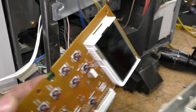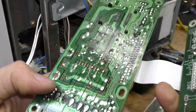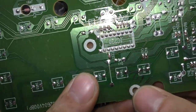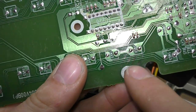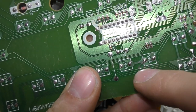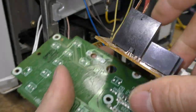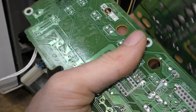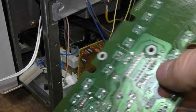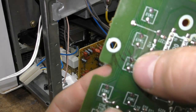The main issue is this track vaporized, with some blackening that I've cleaned off. The way this was packaged, these two PCBs sit facing each other. Opposite where this fuse was, there was a big black mark on this PCB — I've cleaned most of it off but you can still see some remnants. That explosion, the conductive plasma that occurred when that track exploded, actually caused mains voltage to get onto the logic circuits where the keyboard switches are.